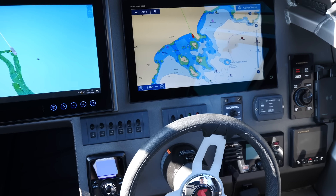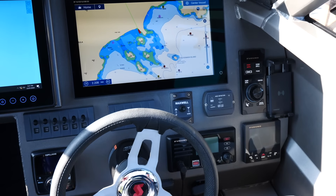Trim tabs, engine starts, volt meter to monitor batteries, gas detector. And like all my other electronics gear — Furuno VHF. Not only do they perform incredibly well, but with the Furuno units all being the same, they all plug in, interface, and talk to each other, which enables AIS. If there are any other boats in the area with AIS, I can see them come up on my chart plotter. The Furuno TZ Touch — I'm a big fan because of ease of use, functionality, and sounding. But over here, something real new for this boat: a WASP. One word — unbelievable. 120-degree wide beam. When I was out the other day in 45 metres of water, I was marking snapper 70 metres either side of me. That's how wide the beam is.